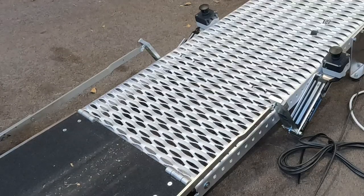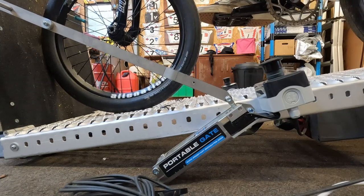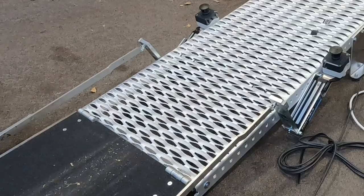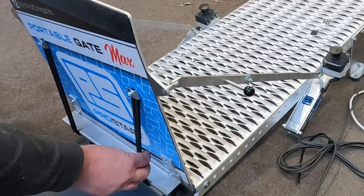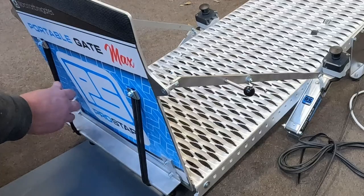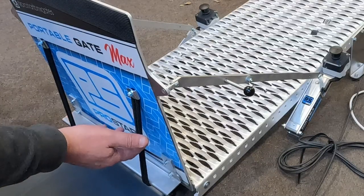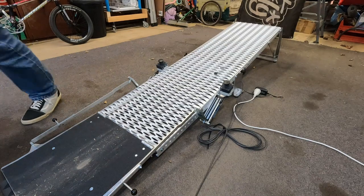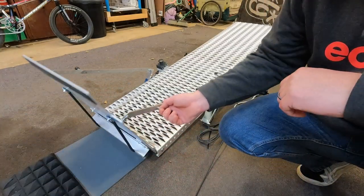These pretty large magnets can hold quite a lot of weight and power against the gate, and they're what release the gate and let it drop. Most race gates these days have a hydraulic ram knocking it down — it's a little bit different being on a gravity gate. You can see here we've got an octopus strap doubled over and a second octopus strap, so it's basically the elasticity of four octopus straps. You can customize it — shorten the elastic strap to give it more tension — and once the gate's released, it'll drop on its own. It doesn't go down as fast as a ram, but it doesn't stay up with gravity either; it goes down with the help of the elastic straps.